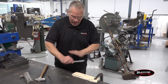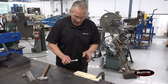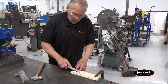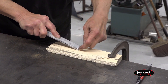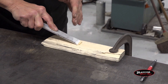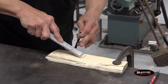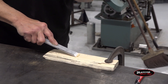Here's the most important thing you need to understand about metal cutting tools and wood cutting tools. Let's say this is a wood chisel and I've got it laying down flat — what am I going to cut? Nothing. Until you raise it up and start getting into the material, and give the tip some clearance to go down into the workpiece, you're not doing anything. In a metal cutting tool, this is called the clearance. In the chisel, you give it the clearance you want depending on how you want to cut, but in a metal cutting tool, this is the clearance, and you have to grind it in to the tool.